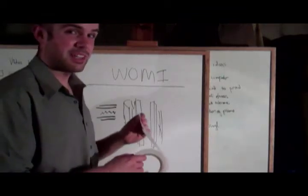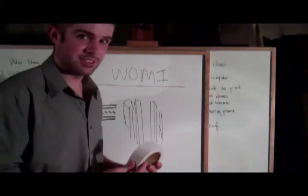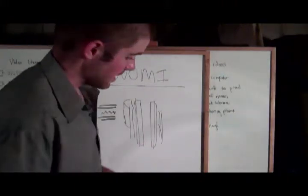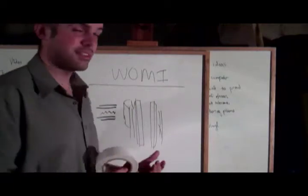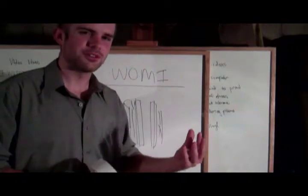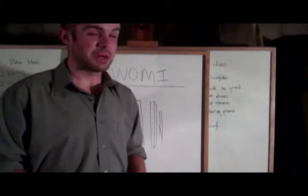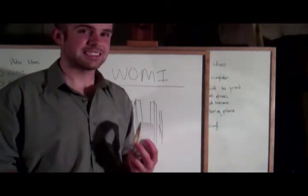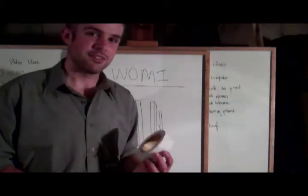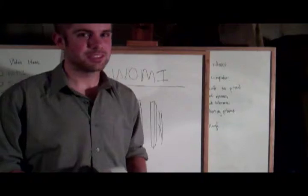The peel ply is not primarily used to increase fiber fraction, but more to compact the fibers into their location. The fact that no vacuum of any sort is being used is a result of the fact that the tube is filament wound using pre-impregnated filaments, or rovings, or tow, depending on how you want to say it. The fiber fraction is already quite high when you're wrapping the tube, so very little excess resin is ever pulled off with the peel ply. In fact, I've found that tremendous amounts of excess resin cause the peel ply to fail and therefore get stuck to the tube, which is unsatisfactory.